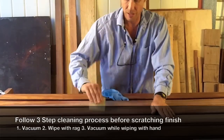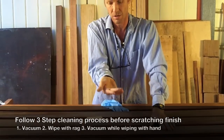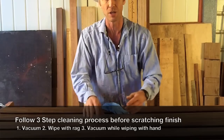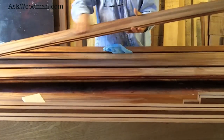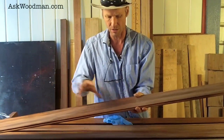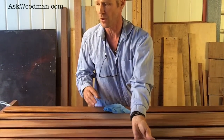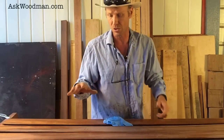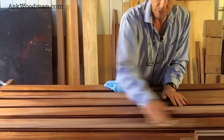As cloudy as this looks right now, you can see that I'm barely sanding but I am pulling some material off — that's the powdered Waterlox dust we've got to get rid of, otherwise we're just going to trap that dust in our finish. I'm going to vacuum that, wipe it, then do the hand cleaning action like I showed you in the first stage. As cloudy as that looks, you think you've damaged your finish — you haven't. As soon as you clean it off and put the Waterlox on, it'll be even more brilliant than last time. And you'll use a lot less material because now you're laying finish on top of finish, not penetrating into the wood as much.